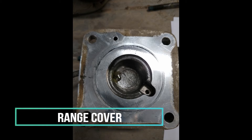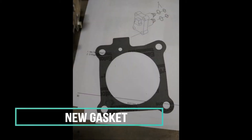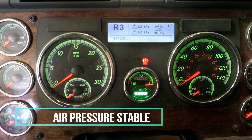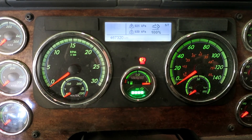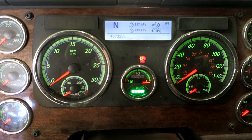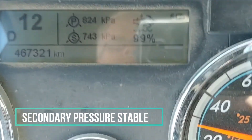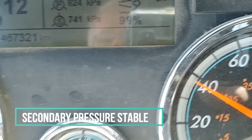Here's the cover — the black line indicates the bottom, that's where the air was coming out. Install the new gasket, and use some Loctite on the bolts as well. So now with it back in high range and the air pressure stable, going to first pin, it all settled in at seven hundred forty kilopascals — whereas before, it would have just kept dropping.